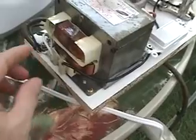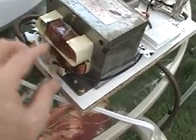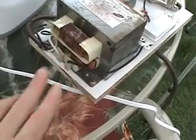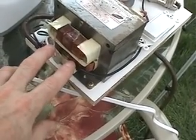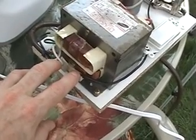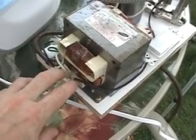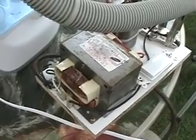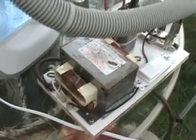I've got a lot of those, and basically I'm just putting the grid power into the primary like it would normally be set in the microwave oven. The grid power here in Canada and the United States is 120 volts at 60 Hertz. For countries using 220V at 50 Hertz, make sure to check — your secondary output voltage will be much higher, so take note of that and do be careful.